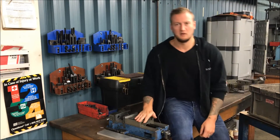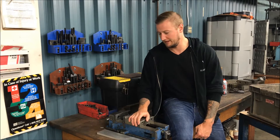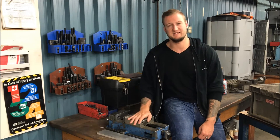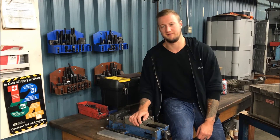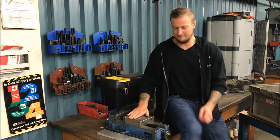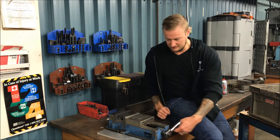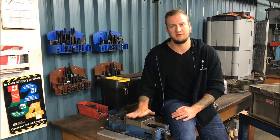So first and foremost: the vise. Regular old vise. This should be your first line of attack on virtually every kind of job that you do because it's the easiest — it's got the easiest ability to be repeatable and accurate, and it's the easiest way to hold things. I can leave vises like this set up in my mills pretty much 24/7 and pretty much always have work to fill them. Obviously you have to have at least two straight sides, two parallel sides. Your limits are going to be how much of the part you're holding — if your part's this big and you can only hold this much, that's going to be an issue. Obviously if you can't open your vise up enough, that's going to be an issue. But this is the easiest way to hold things if you can.